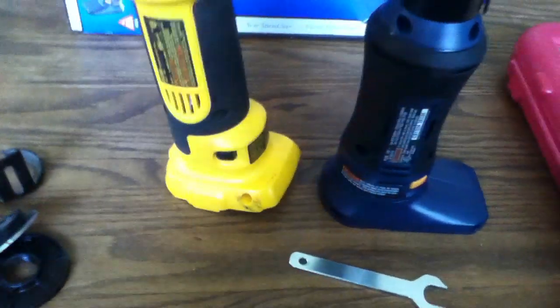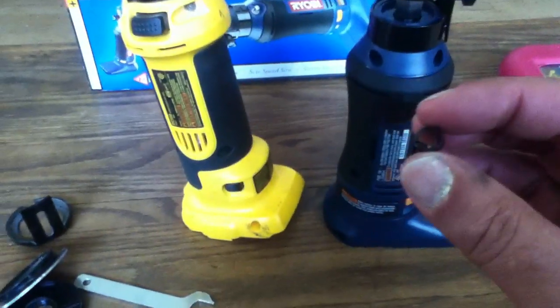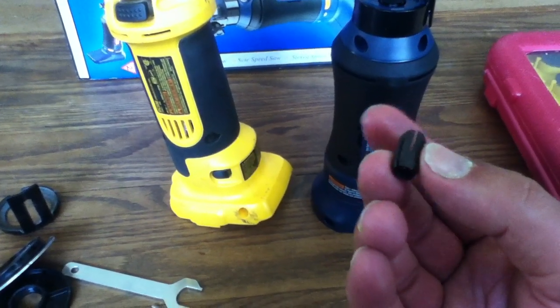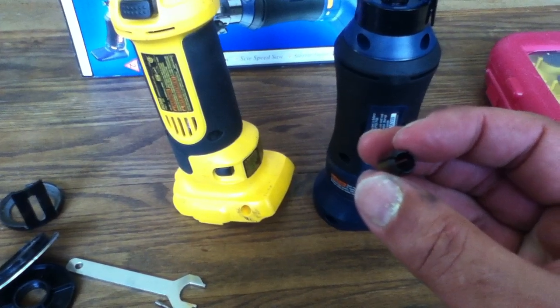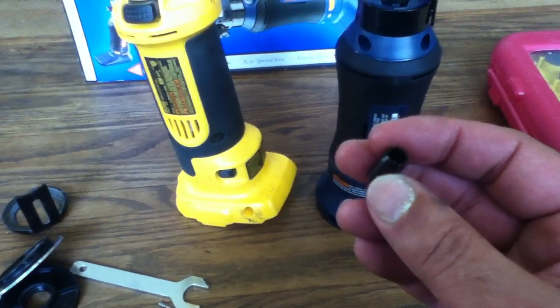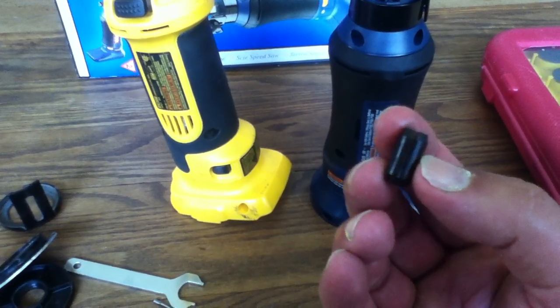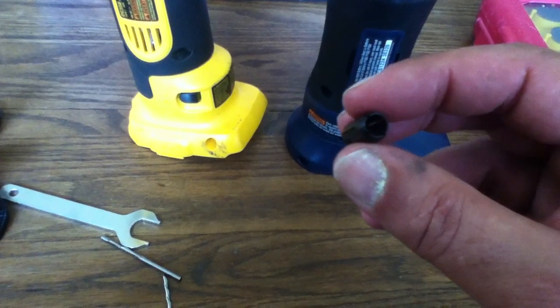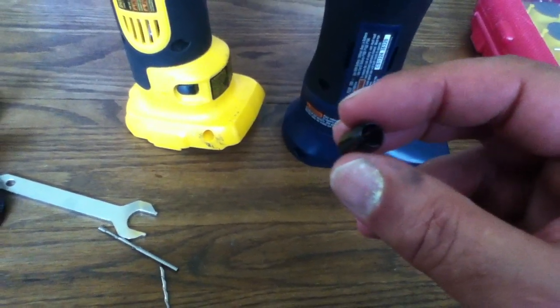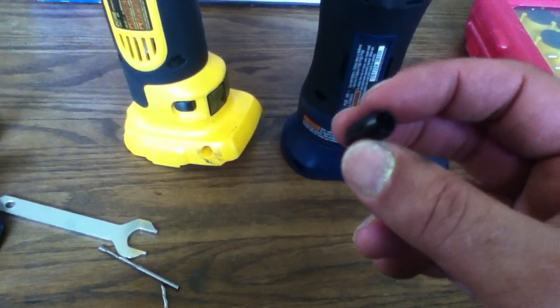These tools are relatively powerful, and a lot of times you can get little spare collets so you can use stuff that's different diameters — you can put regular router bits in these. They're powerful, but not as powerful as a full-powered router, so you've got to use reason in choosing smaller diameter router bits. Remember the ones with the little ball bearing for cutting edges — you could do that, especially for a touch-up or linoleum cutting situation. But if you're using a full-size, full-power router bit on hardwood with this, it's not going to work.